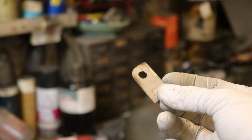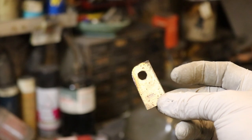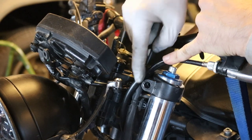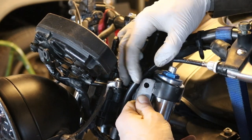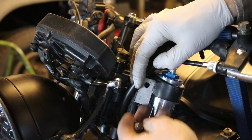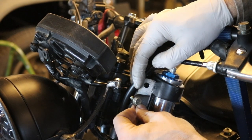All right, I've used similar techniques to make this guy, the longer one, the inch and a half one that will attach to the actual bike. I've rounded it to fit the curves on the top clamp of the bike. So this guy right here, you can see how it rounds on that corner there. This matches that, so it should line up pretty nicely. I'm gonna bolt this on here, clean all this stuff up for welding, and then we'll see about welding this one on here.